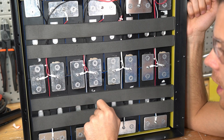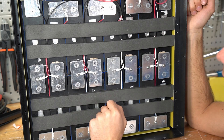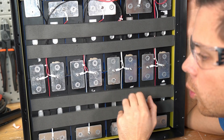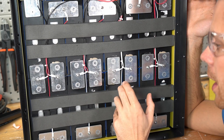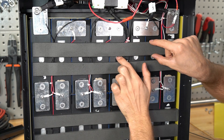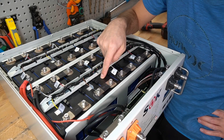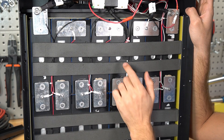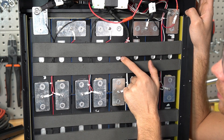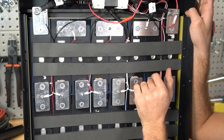Personally I prefer the SOK battery — the cell holder is rock solid and will last a century. The foam and tape will work as well and a lot of high quality batteries use it, but I like SOK better. Also notice that the foam is obstructing the over-pressure relief valves; SOK has no obstruction. I wonder if that's safe — I think it would still vent fine, but not as well as if it weren't obstructed.